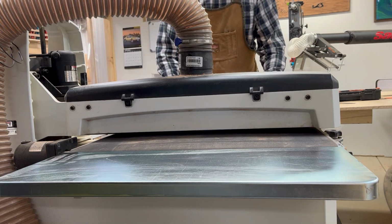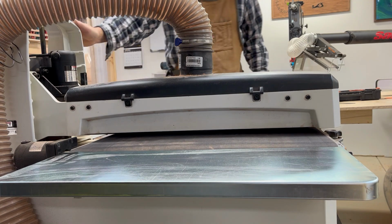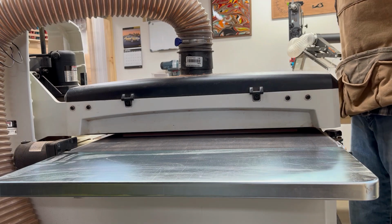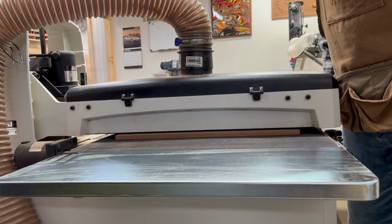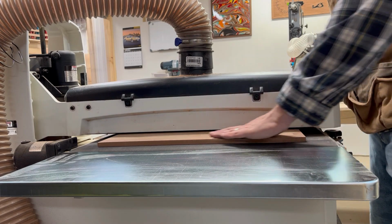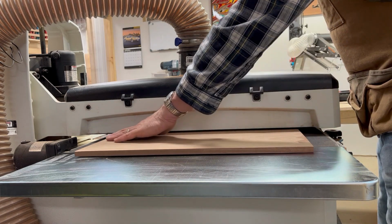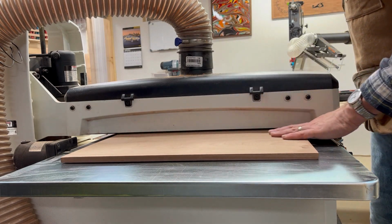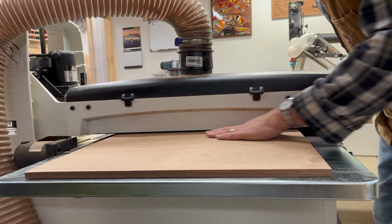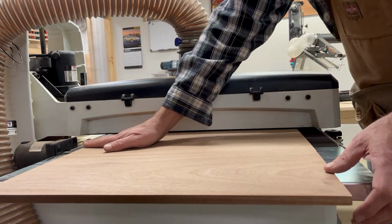So this piece of equipment that you're seeing in front of you here, this is an oscillating belt sander. It obviously rotates and also oscillates right to left. And the nice part of this piece of equipment, it allows me to sand down flat pieces like this to perfect thickness. So what you end up doing is you flip it on one side and flip it over to the other side, and just constantly checking to see if there's any defects.